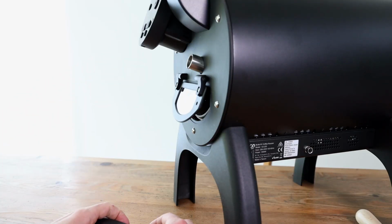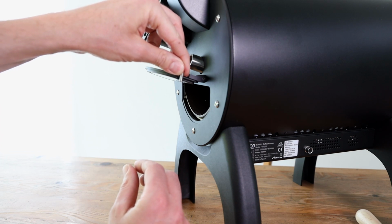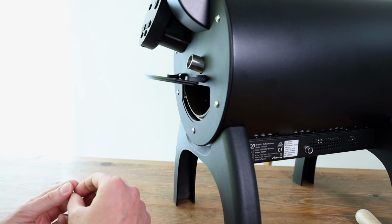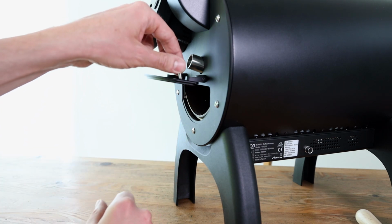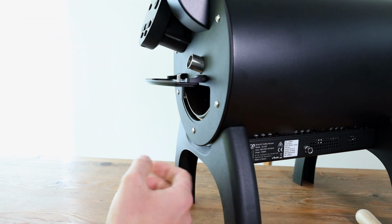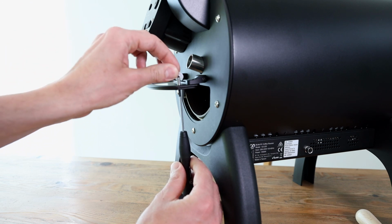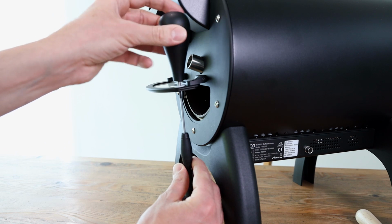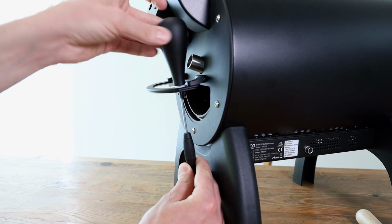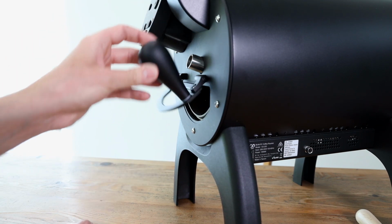When installing the doorknob at your door, there is one thing you have to take care of. The screw doesn't have to be looking out here from the door inside the drum, because like this it would touch the drum and there would be some noises coming from the drum. So it has to be here flat, and the way you do this is put it in until it's flat to the back side of the door. Take your 2.5 tool, hold it here. Then also very important, take your white washer in between the knob and the door. And now you can turn the knob on the screw and hold on the other side with the tool. Like this, you can tighten it, and so you have the knob perfectly installed.